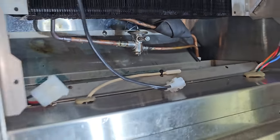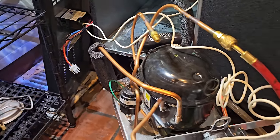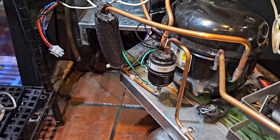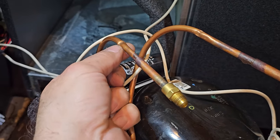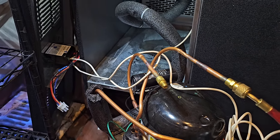We're good. Time to start getting out of the dryer, cleaning up all my messes and everything. My goodness, I really had to work to get that condensing unit out, cutting zip ties and everything, and then got it twisted around so I can get to that dryer because it's in an awkward spot. We gotta get that changed out without burning everything up. Also need to replace these process stubs and get rid of the pinch points because those are potential leaks in the future. We're not going to be pinching this off when we're done, so